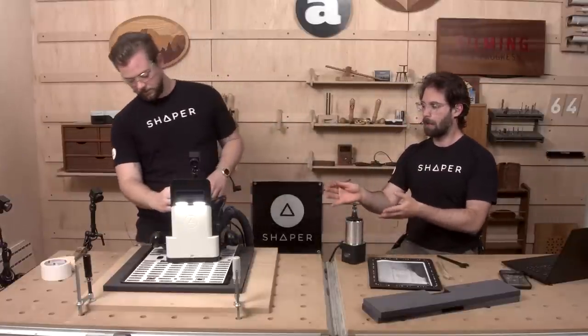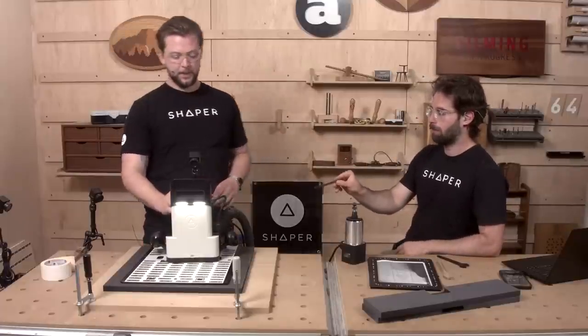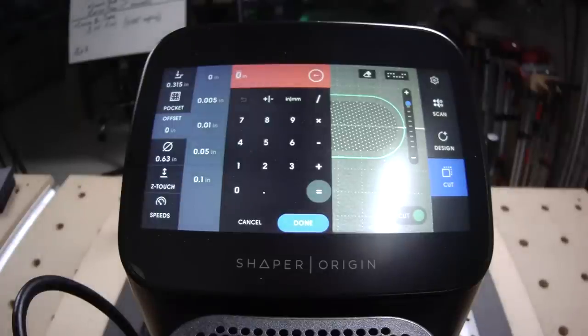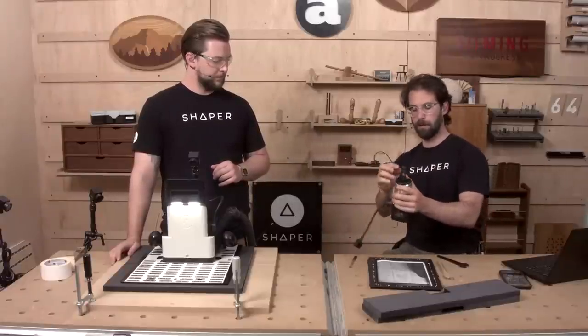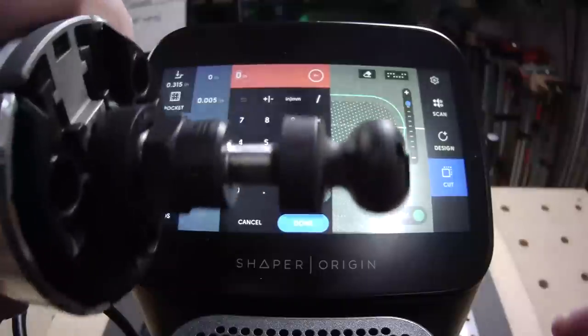And you're clearing that out. Now, hold on a second. We're clearing that out with the 16mm router bit. Now, did you include that offset clearance there? I did not. So this is something that we found out before the show. I always want to double check this stuff. Because this undercut has this cutaway portion here, and actually let's show that on the Origin cam.